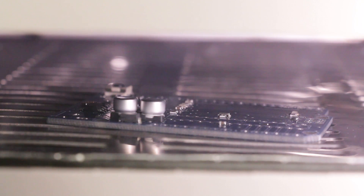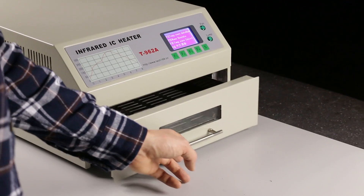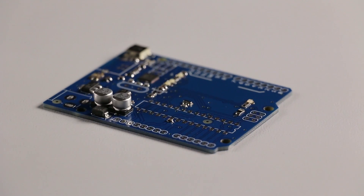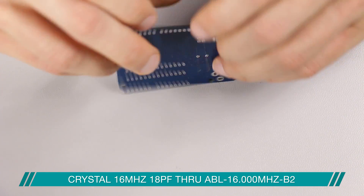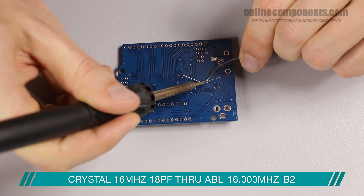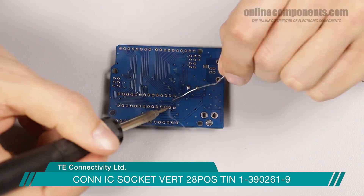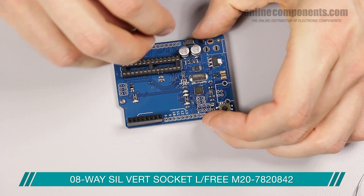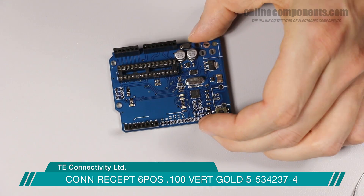Finally, just showing the effects of cheap materials — you can see the oven bed twisting in the heat, which for us isn't a big deal. After the cool-down period and the solder is solidified, the board is still too hot to touch, so be very careful. Now we're going to finish up with the through-hole devices, where you can once again see my shaky hands. First, we put on the 16 MHz crystal that the USB-to-serial microcontroller uses, then trim the leads or it's going to sit weird. We then do the socket that the DIP package microcontroller sits in, before moving to the headers. The headers are 0.1 inches in pitch, but with odd gaps between some of the pins — supposedly an accident that has continued through the years because they want to keep all generations compatible.